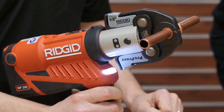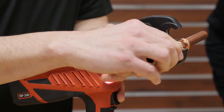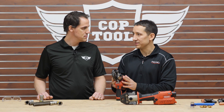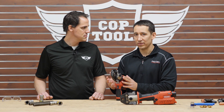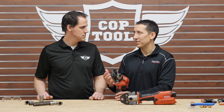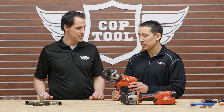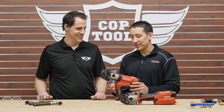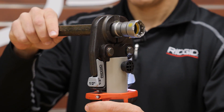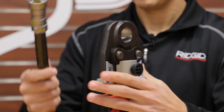Additional sensors give you a green light when a proper press cycle is complete, so you know the joint is fully pressed. There are also service indicators: the tools run 32,000 cycles before needing service, and at 2,000 cycles remaining, a yellow light flashes as a warning — much like a car's oil change reminder — guaranteeing the tool always functions properly.